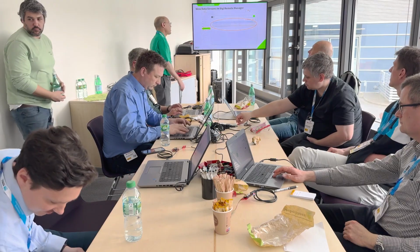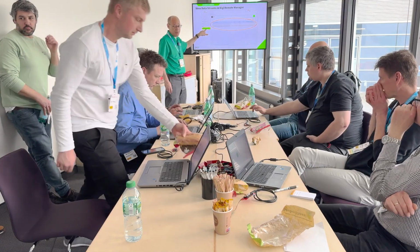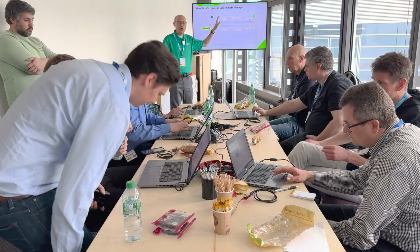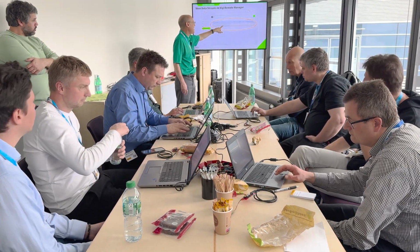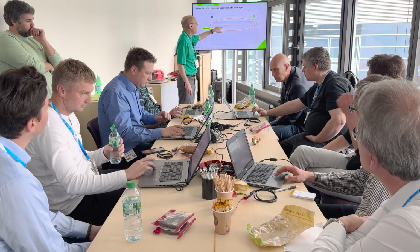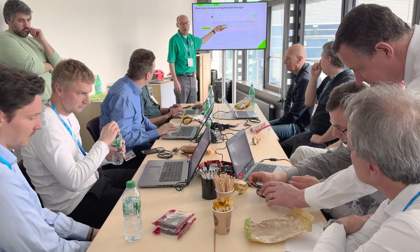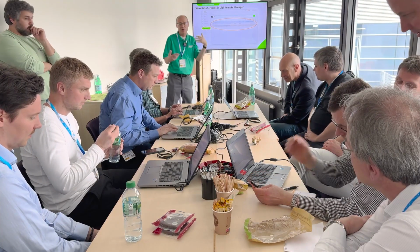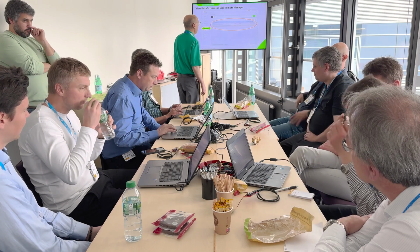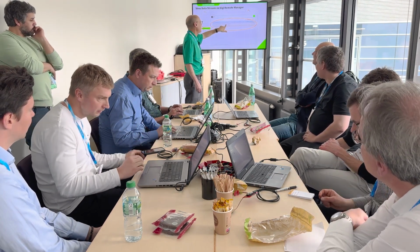Okay, and then once you are in, we're going to go on the left navigation to data streams. And if everything worked well, you will see a live data stream that ends with your IMEI number. So mine ended in 3143. I was the only person in this account, so there's just two, but there should be a lot of other stuff in your data streams. So you should be able to see your temperature and humidity values.